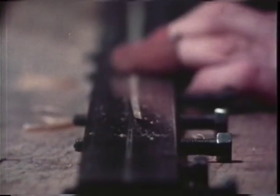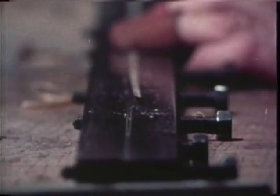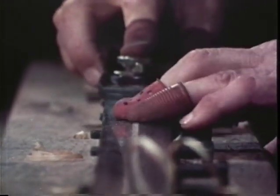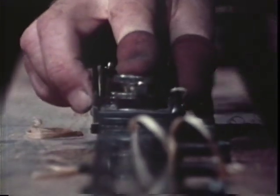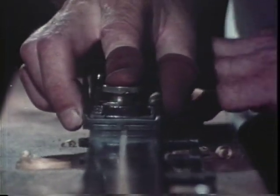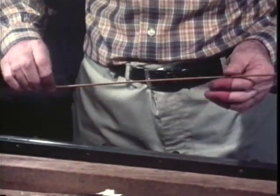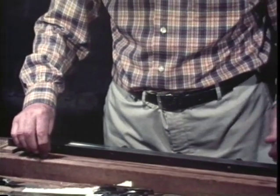Gradually work into the taper that we want to attain at the final stages. Now we change our planes. And I'll continue planing until I no longer pick up any material. Now we've got this strip laying down as far as we can get it in the preliminary side of the forms. And our cutting is fairly clean.